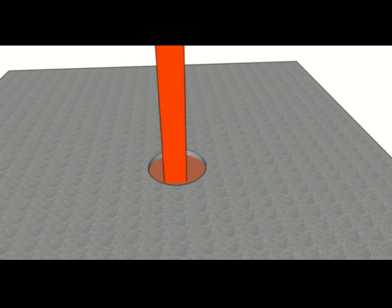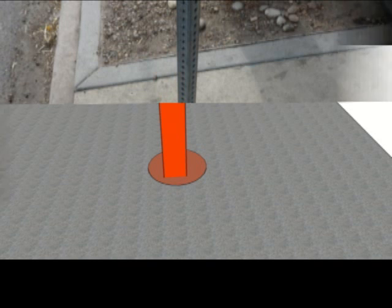They might have other things you could use as well. But the main thing is to fill the hole and, if possible, make it a little bit higher than the existing walkway. You can see in the picture — even being flush with the walkway or the ramp will provide an area that will at least keep water from pooling up around the bottom base of the post.